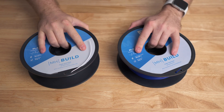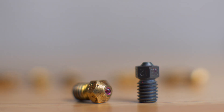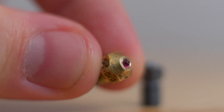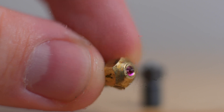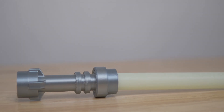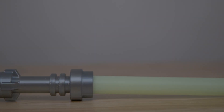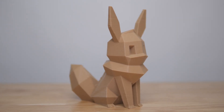There are more advanced PLA materials that contain abrasive material inside the plastic, and to print with these you actually need a nozzle made from a hardened material — something like hardened steel or a ruby tip. These nozzles enable more exotic materials, things like glow-in-the-dark PLA which contains strontium particles that absorb and then emit light, and wood PLA which contains real wood fibres that can be sanded, stained, and treated like real wood.